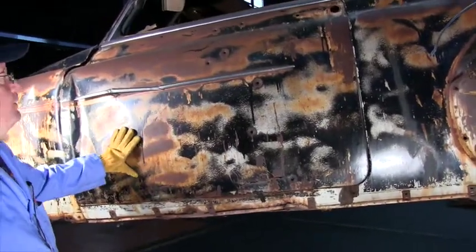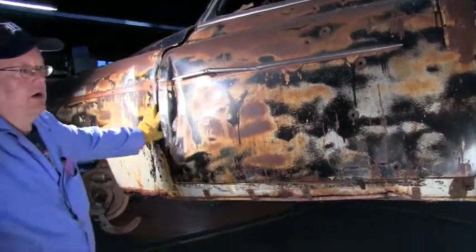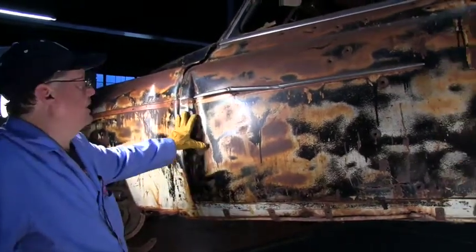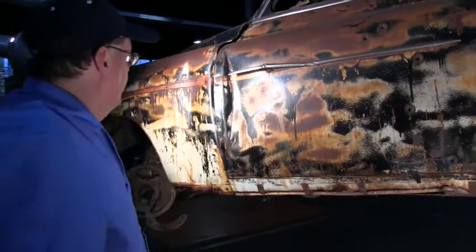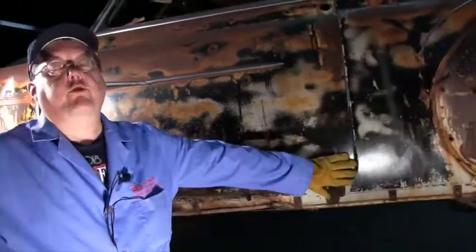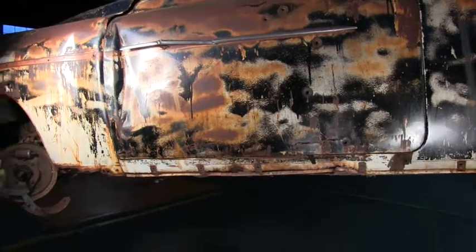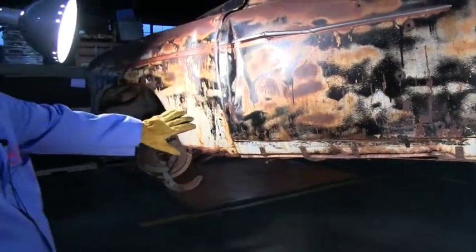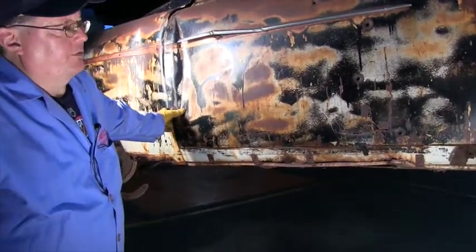And in order to do that, you need to do the parts around it. This one has the fender on it. You fix that. There's a lower cowl behind it, which actually holds the hinges. Now you got to remember, if you're off a 64th of an inch over here, you multiply that by a 4-foot door, this thing's way off. This is why this is so important. You want to make that gap fit right and look good. That's what makes a car look good at the car show. It makes the work easier for you.